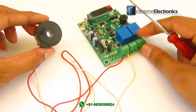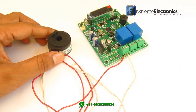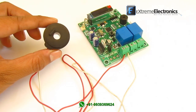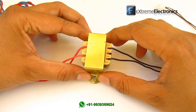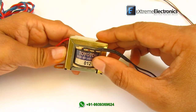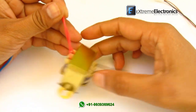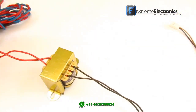Done — it was so easy! Through this hole, pass one wire of the power supply line of the water pump. Here is a small transformer which powers the main board of the system. It has an output voltage of 12 volts and 500 milliamps current strength. This is a very simple and low-cost transformer. On the input side we have connected a standard plug.